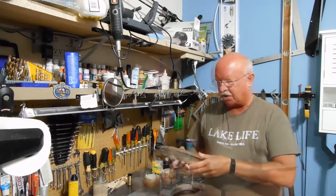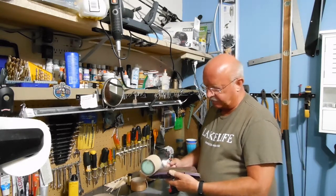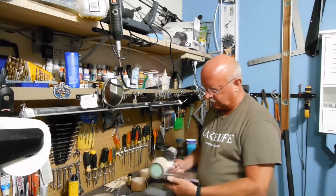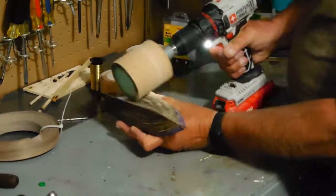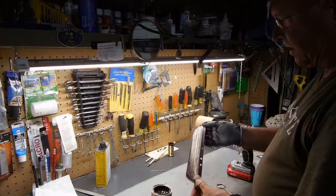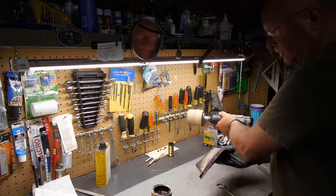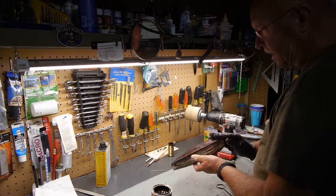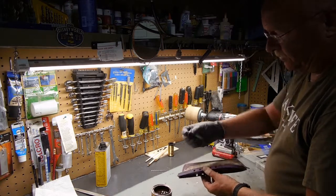I've finished putting the planks on, and I'll begin getting some of the rough parts off of this. I'll do a lot of it by hand also, but to start with I can use this. Once you've sanded it as smooth as you want, then I'm going to go ahead and stain this. And I don't mind it being rough looking. So what I've decided to go with is I'm going to stick with the black cherry — I've done it on that side. What I do is I take a small piece of cloth, dip it in the stain, and then I just rub it into the wood.